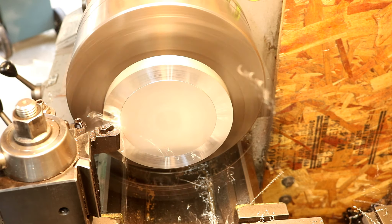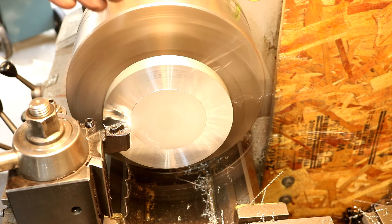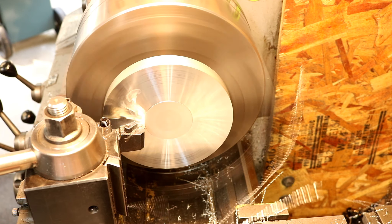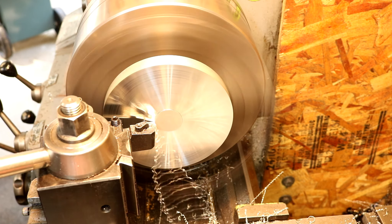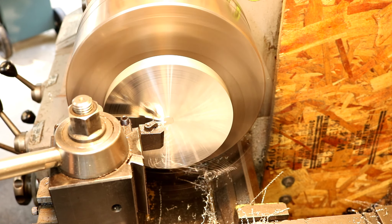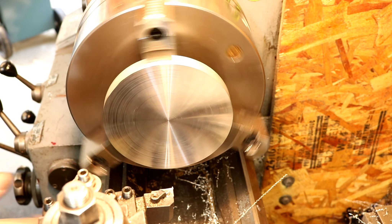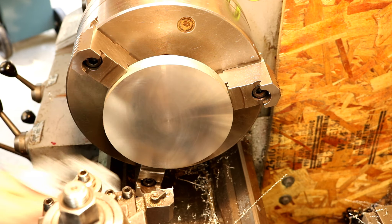You can see how the chips change as the surface feet per minute changes. I don't change the RPM, but as you get into the cut the surface feet per minute changes and you'll see the chips actually change — right now they're real short curly little things, turning into longer chips. There's a good example of showing that. I'm turning 875 RPM here, and it came out to be a beautiful, very nice finish — very smooth.